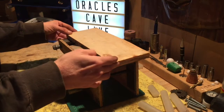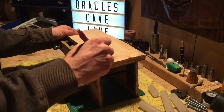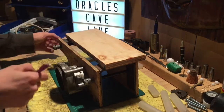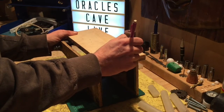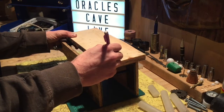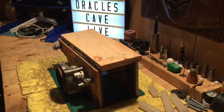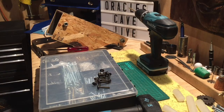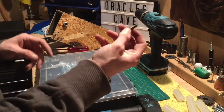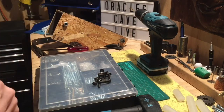The holes marked, we'll roughly gauge where the metal is. We'll just do two holes, maybe spread them apart a bit. We'll zap two holes through there and then mark it into the metal. We've got the first bracket drilled out, two up here, two on each side. We've got them fitted out to fit these little allen-headed bolts. They seem to be the right thickness, at least for the top chunk.